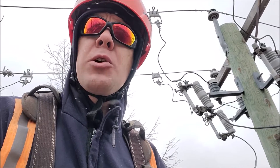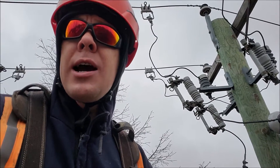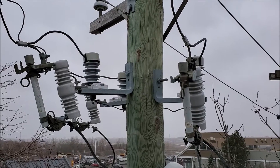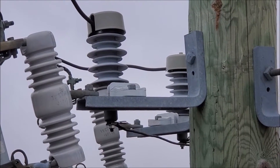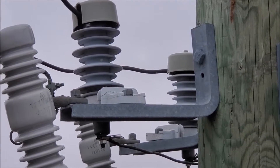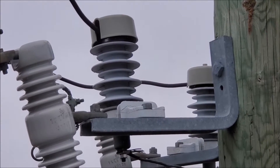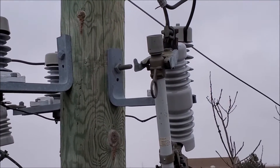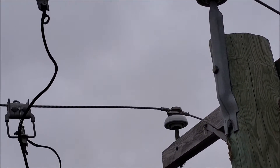So we're up in the air here now. One of the first things we're going to check before we get any closer to the work area is a visual inspection of all the equipment on the pole — any loose ties, cracked porcelain, pretty much anything that can be a hazard while I'm in this workspace. One of the things I noticed during my inspection: you can see this lightning arrestor on the center face — there is a small crack on the attachment point where it's attached onto the L-bracket. That's not interfering with that device electrically; however, it will at some point likely fall off that bracket and cause some issues. There doesn't appear to be any other cracks in the porcelain — everything looks good on the pole, everything's tied secure, pretty good shape.